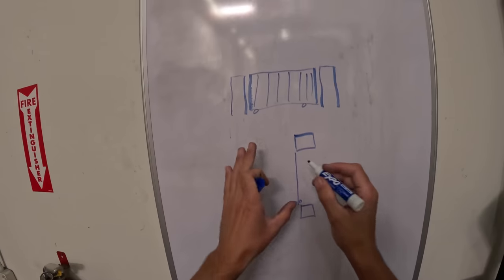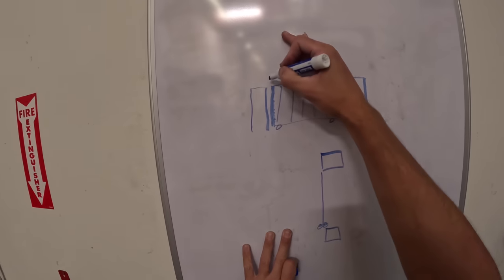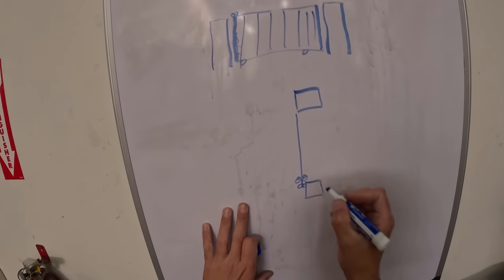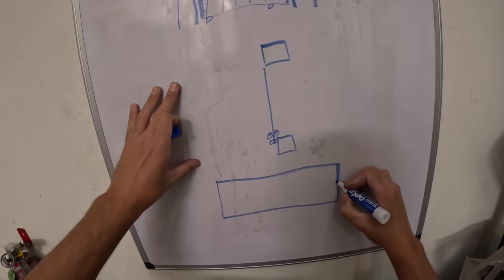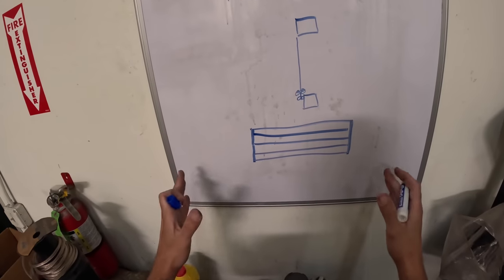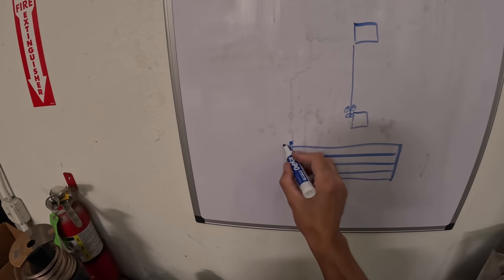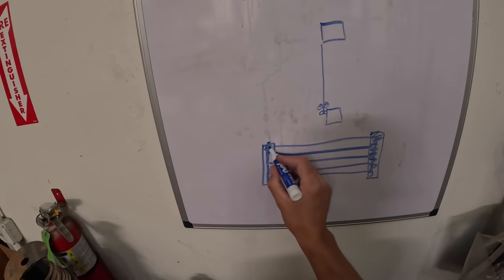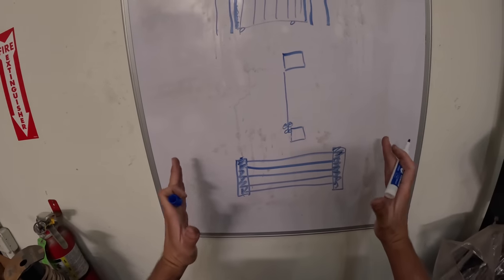Typically if you have a gate, you have an entrance — let's say block column, block column, and your gate in between. On these ends you have your two-by-two and your two-by-two framing the gate in, plus wheels. If I'm designing this gate, I want these two-by-twos to be inside the column as a decorative feature. The problem is, when you put your roller guides on, they need to entrap both sides of the gate. If the gate is all the way out in the opening and the roller guides are out in the open, you'll have a post in the middle of your opening.